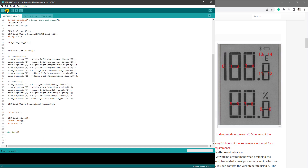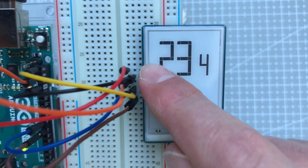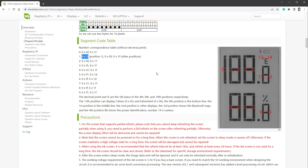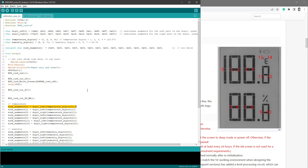After uploading, you'll notice two things: we don't see the first digit — digit number 1 — and we also don't see the decimal points, degrees Celsius, and percentage sign. Looking at the documentation, digit 1 when displayed on position 0 should be 1F, and on any other position it should be 001F — meaning the left side is empty and 1 is displayed on the right side. Since we are displaying the left digit and showing 00 for 1, nothing is displayed. So we need to set the first digit to use digit_right — that way we'll show 1F or 00 if nothing is being displayed.